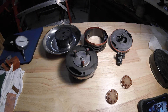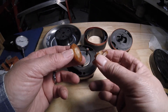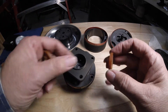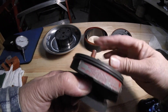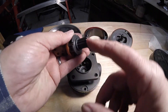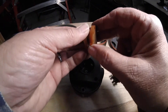These things are designed so that when something breaks in here or it binds up, it has a shear piece here that will basically shear. This half connects to the actual drive mechanism that drives this, and the other half is actually geared into the accessory plate of the motor engine. If it binds or anything, it shears.